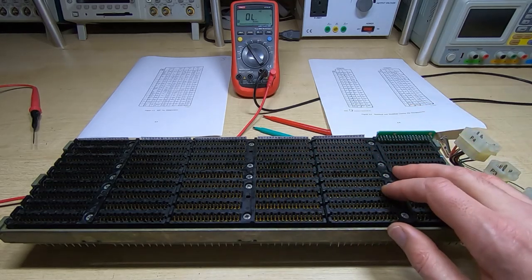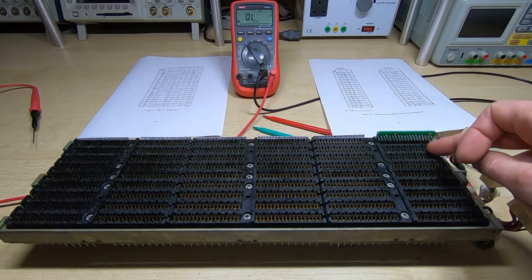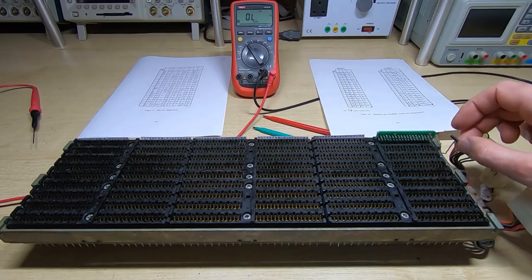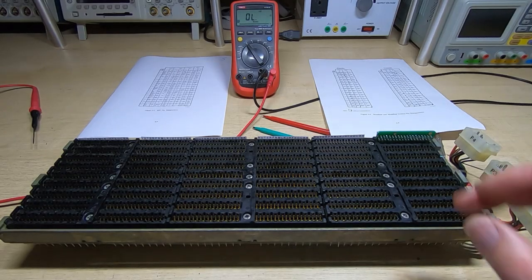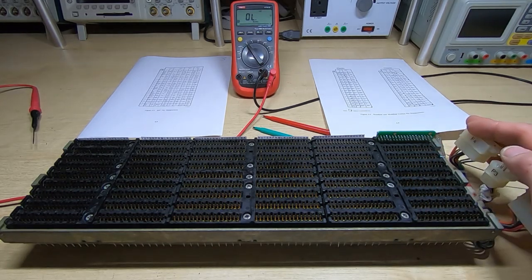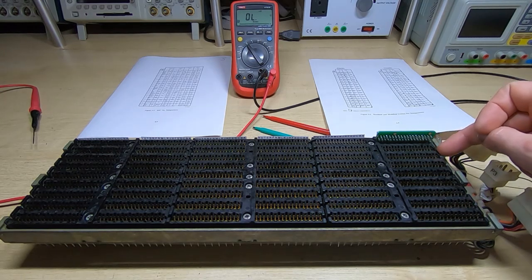Before then I want to show how I go about testing this — it's not as difficult or time-consuming as it may appear, at least not once you get organized. What I've done here is make up this small adapter that allows me to connect to any one of the Unibus pins, or in fact any pin in any of the connectors. I just plug it into one of the slots and then connect my multimeter to one of the sockets on here. Just bear in mind we have slots A, B, C, D, E and F — A is on the right next to the power connectors, and the rows are numbered from the front: one, two, three, up to nine.